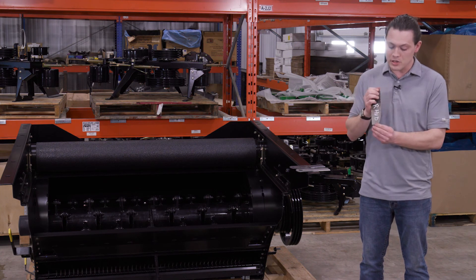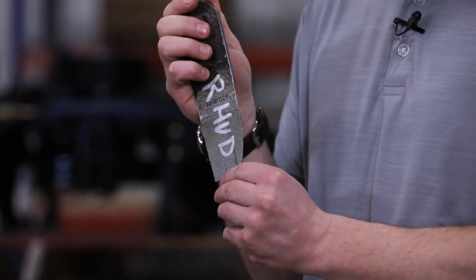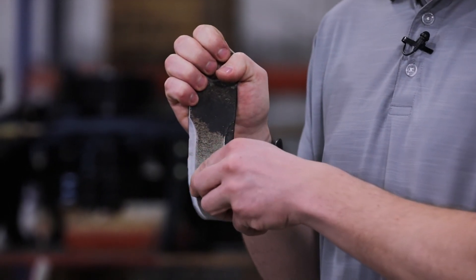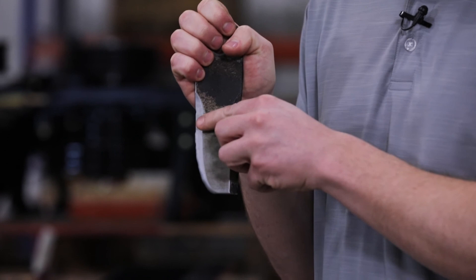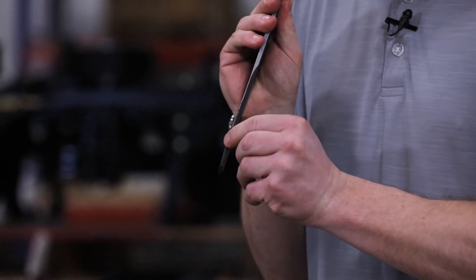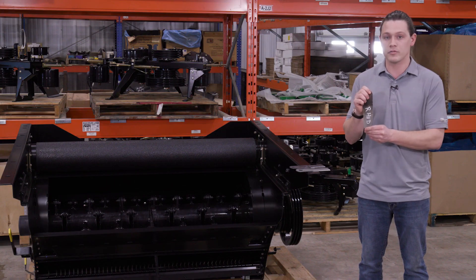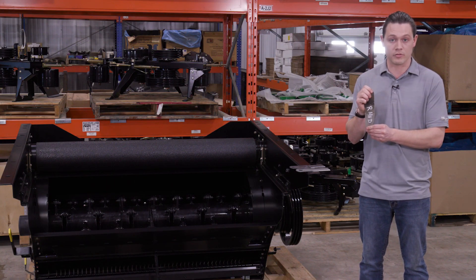The carbide serves not just as a wear inhibitor on the blade, but as you can see here, you've got a lot of wear in the soft material creating quite a beveled edge, but that hard material doesn't wear as much and it actually maintains the sharpness. So you can maintain the chop out of your blades throughout the life of the blade.